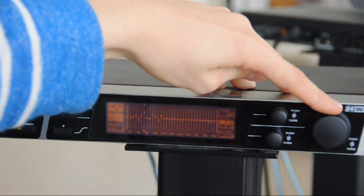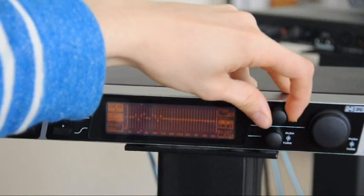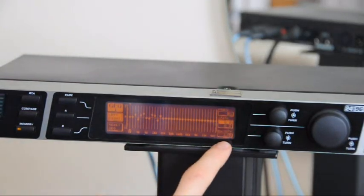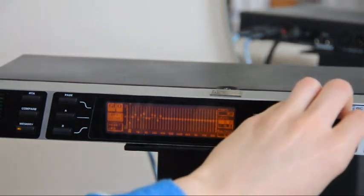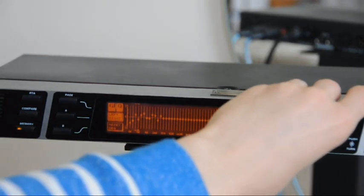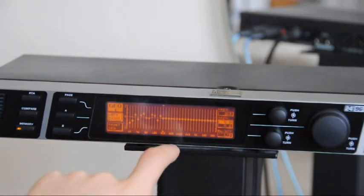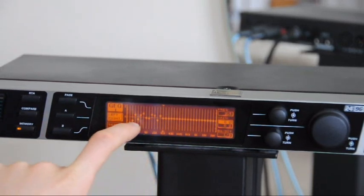At 63Hz there may be around 6.5dB — reduce that down to about 5dB maximum. There should be reasonably subtle correction in there which will really help balance out the frequency response. For a small speaker, even though at 20Hz it says it's not applying any EQ, we can reduce the output there — turn 20Hz down to about minus 8dB and 25Hz down to minus 5dB, saving the small speaker from working too hard. There should be nothing above about 300Hz, as we didn't want to apply EQ in that range.